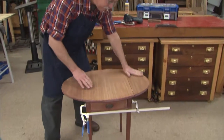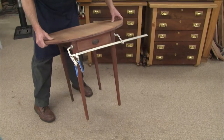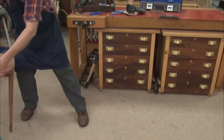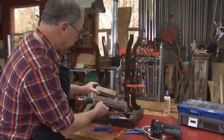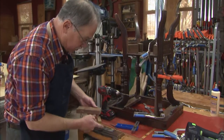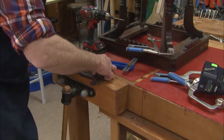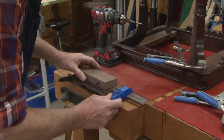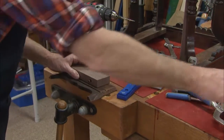Okay, we're halfway home. Now, whatever you do, when you put a new finish on this, make sure it's tacked clean. Surface prep is key. So I'll let that cure out just a little bit more, let that glue get a little bit stronger. And as we go to repair the rest of this Victorian nightstand, well, I already brushed out the Goodwood glue here and have it on the mating piece, and that's tacked for about 5 minutes.